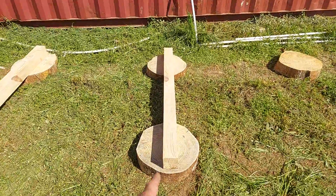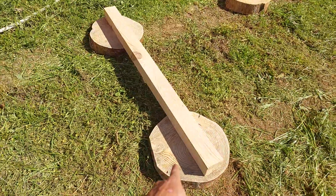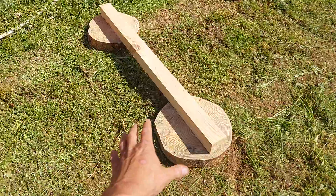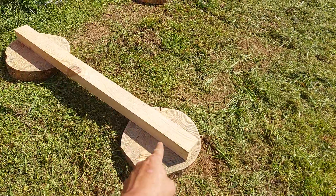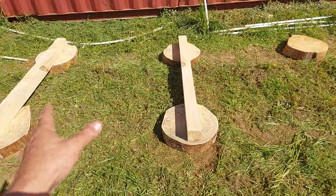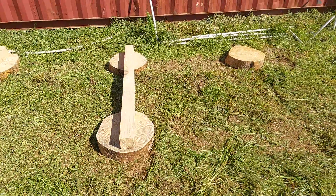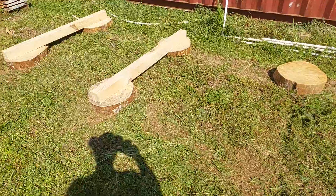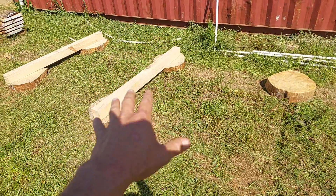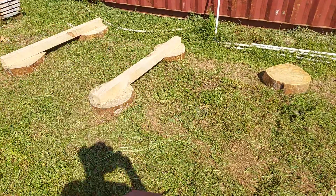One piece of waste was a five-foot log, and that's what I got these four-by-fours from. What I've decided to do is cut the cutoff waste down to about four to four-and-a-half-inch pieces — little 'cookies,' you might call them — throw those on the ground first, put my four-by-four on top of that, and then start stacking lumber. This will be for ten-foot lumber. I haven't decided whether to use five four-by-fours or three — if anyone in the comments has experience with stacking two-by material, let me know if three is enough or if I need five.